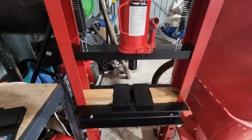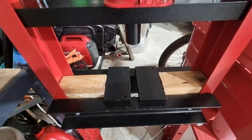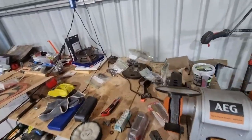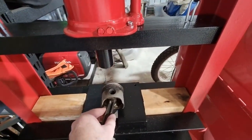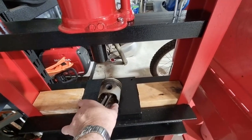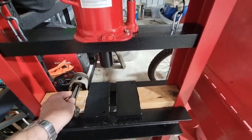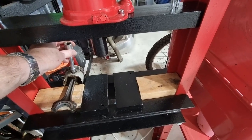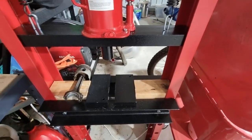The press is all set up. This is how I'm going to be pushing the wrist pins out of the old conrod and piston setup. I've added these blocks of wood because the piston is round and cylindrical — it's going to have the tendency to try and spread those two plates apart, and I just don't want that to happen. The other part of the setup is just an old socket — it fits through the small end of the conrod — and of course we're pressing it out like that.